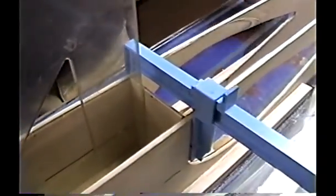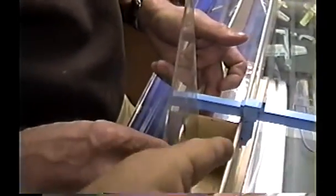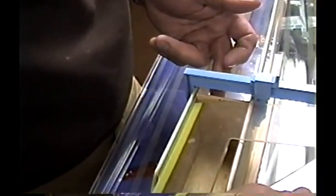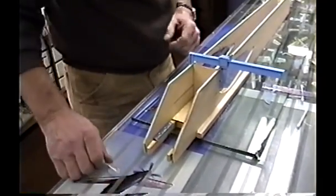That sets that. We move the clamp back just a little bit. Once you take that out, then put another clamp in front so it pinches it together. Now check from the top that you've got 90. Okay. See, because you've got plenty of time while everything is clamped in dry in here. This gives you plenty of working time.